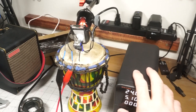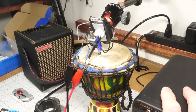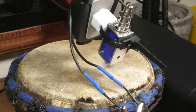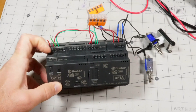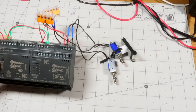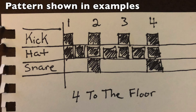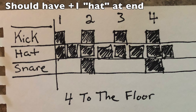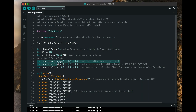First I did some experimentation manually cycling a solenoid with my power supply to see if it hit the drum properly. The PLC is wired in a bit of a kludgy manner as shown here. The audible internal relays act as a hi-hat for a four on the floor drum beat, while silent SSRs in the expansion module fire solenoids that hit a drum and the power supply itself in the sequence shown. Code is available in the description. It loops through as a code-based sequencer following the highlighted one on zero off pattern.